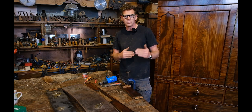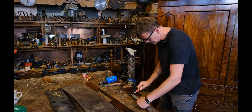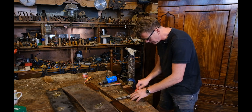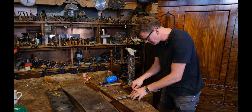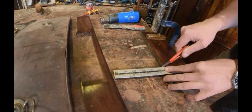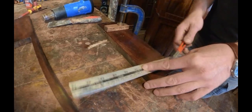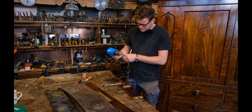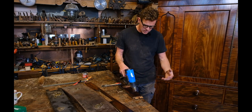It'll be almost ready to size to start working straight away. For the first repair we need about two inches - we'll oversize it a bit because when we come to put it on there's a tip I'm going to give you about fitting veneer patches. I'm literally using a craft knife to score a line down the veneer with lots of passes, making sure it goes all the way through. Now I start to warm it up nice and gently - we don't want to burn the veneer, otherwise the piece is useless.